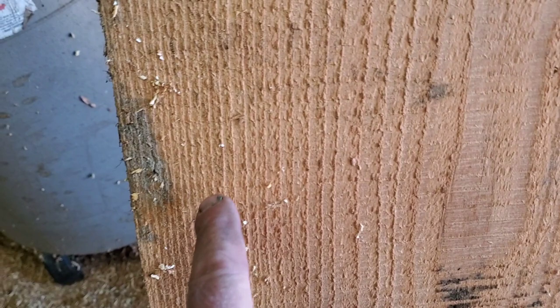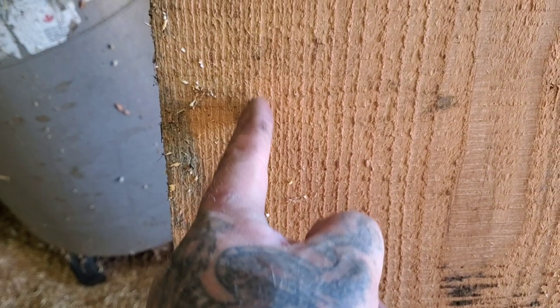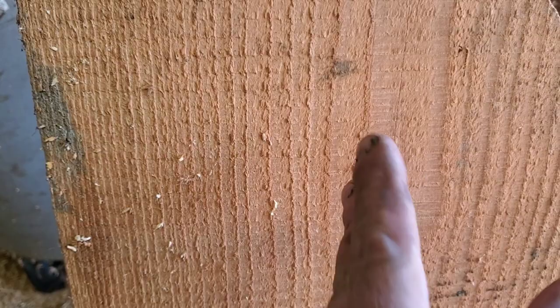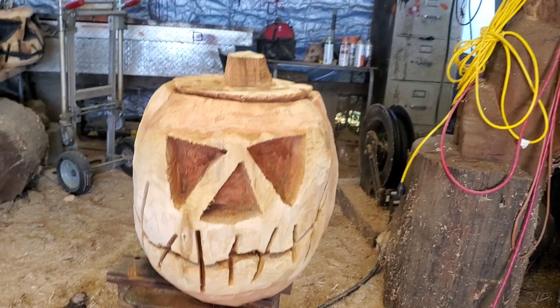So when you carve this face grain, you're carving into layers. Pretend there's paper layers, one layer, two layer, three layer. You're carving the paper sideways. When you do it this way, you get a way better effect. When you do it this way on the edge grain, all you're going to see is those lines, okay? You're not going to get the native effect of it. So this would be face grain. You see a layer here, a layer here, then it goes off to edge grain. Do it face grain, guys. You're going to get a way better effect. And that's just my opinion.